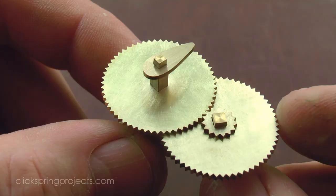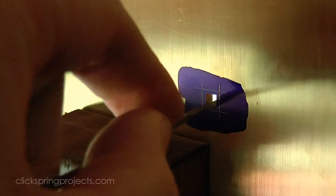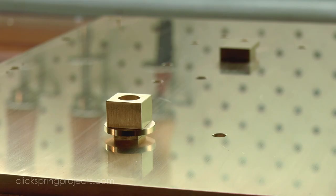The main plate was then opened up and the square bearing hole formed. These two positions are essentially absolute locations, governed by the dial artwork, and depthing could have been conducted from these positions before filing out the square hole, but at the risk of the position almost certainly moving as the square was formed, and so compromising the depth.